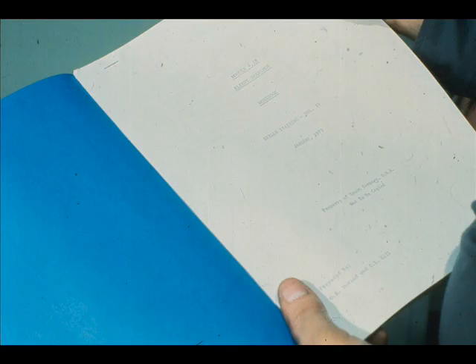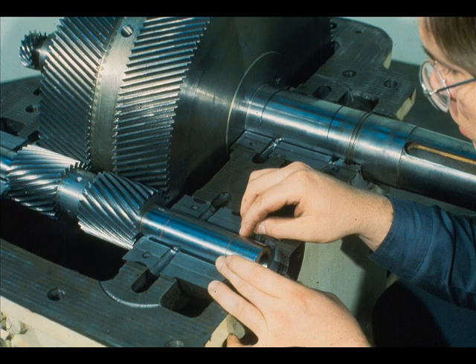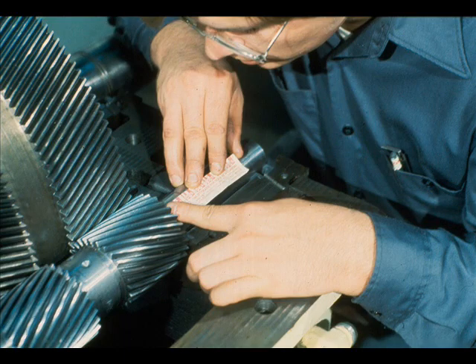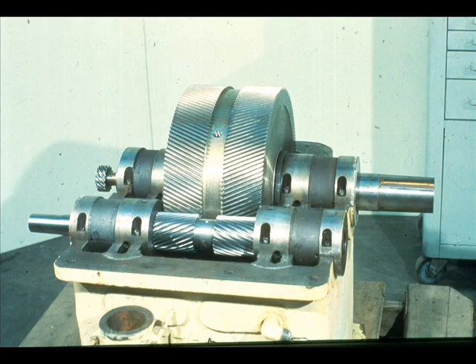Now in accordance with your previous instructions on the installation of sleeve bearings, module 4.18, the following must be checked: the bearing to journal clearance; the bearing shell to the case housing fit, if warranted; and the bearing alignment with the shaft.